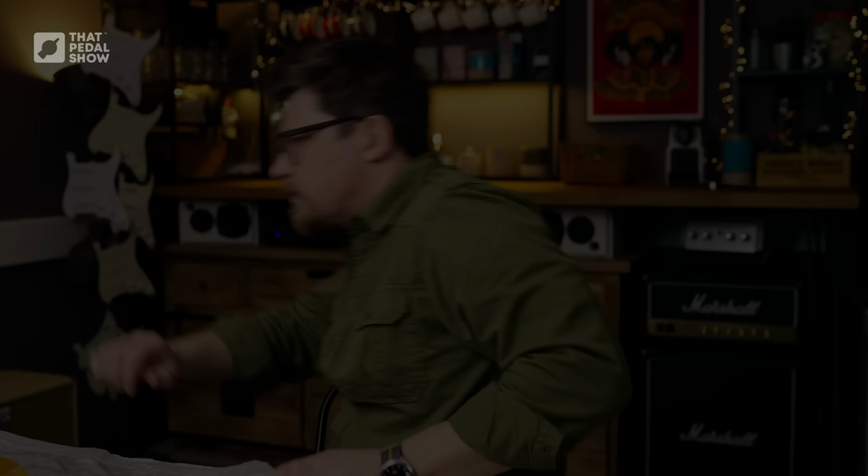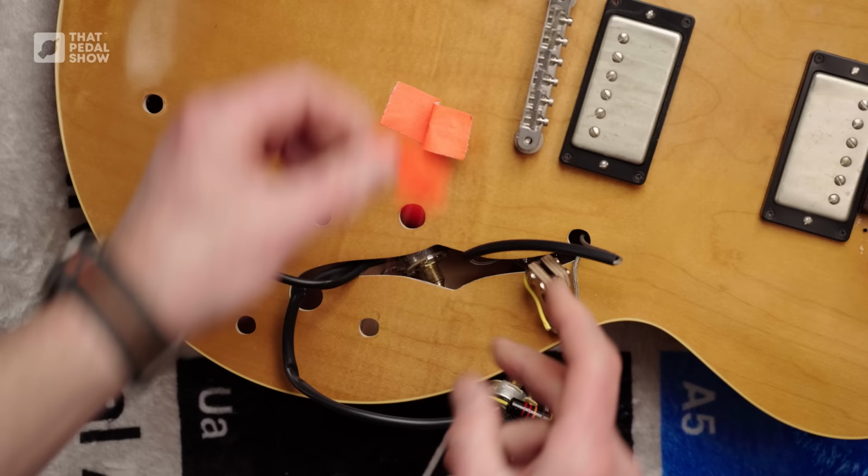I'm going to have to get some advice. It might be Revelation O'Clock. I just Googled it and went through a bunch of videos, and with thanks to the Guitaristas and Matt at Monty's, apparently you can go through the bridge pickup cavity. Seen it done on a couple of Epiphones, not sure about Gibson. So off come these strings then. If this is true, I don't want the bridge posts to move, so I'm just going to tape them so they can't move.